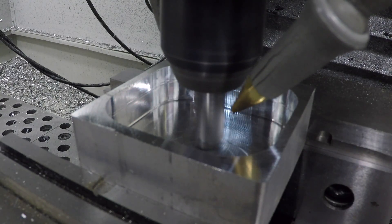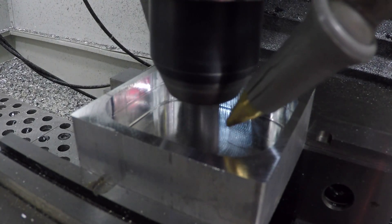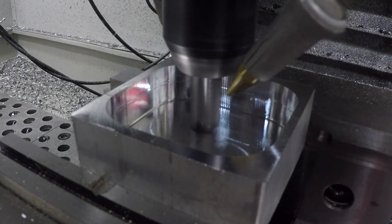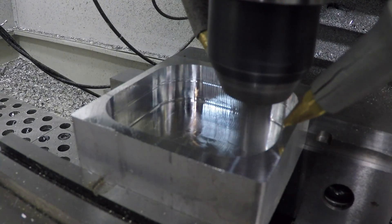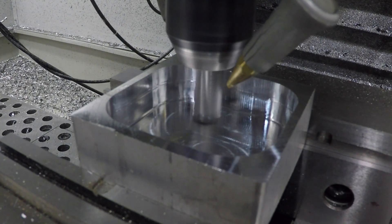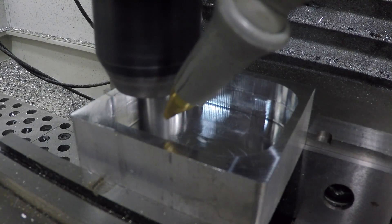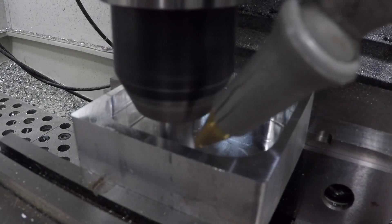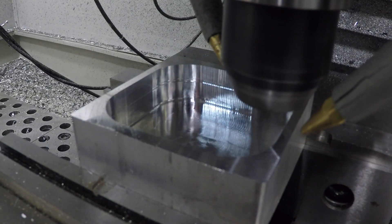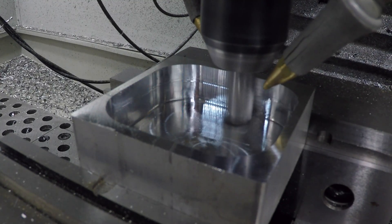Tool 11. This is the half-inch rougher and honestly, it's not even cleaning up much. That actually left a much better surface finish than I remember. We are running this at 2,800 RPM and 20 inches a minute. We can take pretty beefy cuts with this — there's a video we did pushing it to the max. Here we're really just using it as a cleanup tool, a little bit faster than a quarter inch because it has more diameter, but we'll still use the quarter inch to get into those corners.